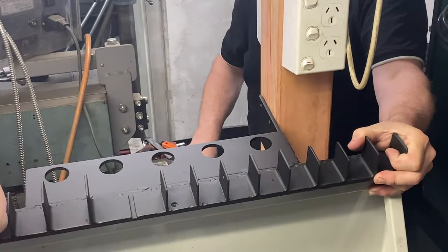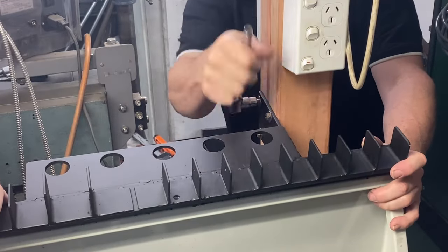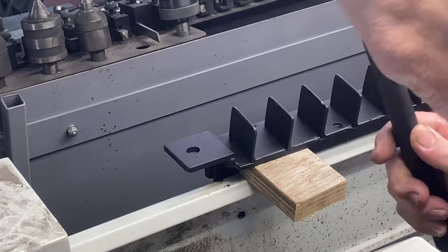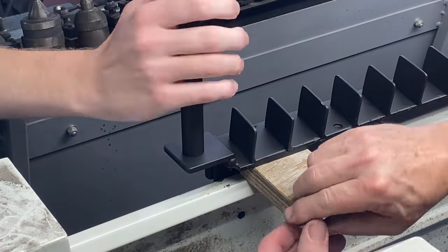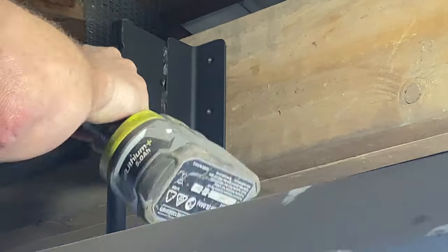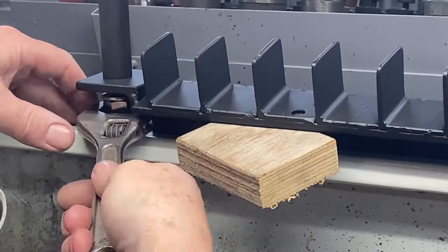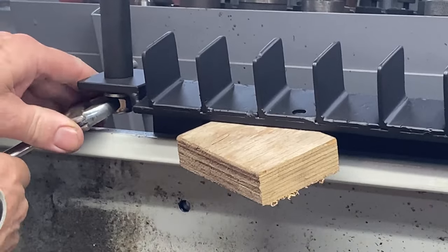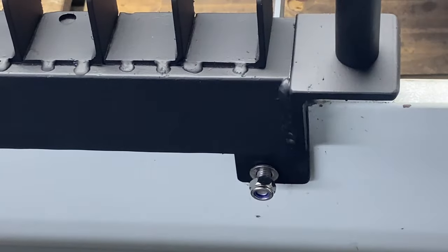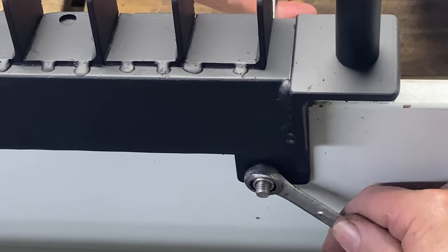This tool holder is really solid and quite heavy, so I've got my son helping me install it. It's fixed to the post at one end, then at the other end we put that bar through the bracket, a nut is put on the bottom, and at the top that bracket gets screwed to the beam in the ceiling. The nut is tightened up — that's pretty solid and will take all the weight. To stop it moving sideways and keep it parallel with the splashback, I use a bolt and nut through the lower bracket, using nylock nuts everywhere to make sure they don't come loose.